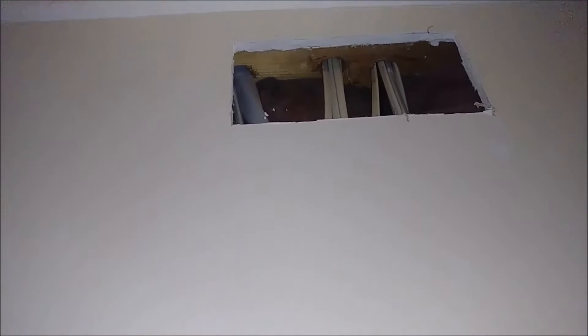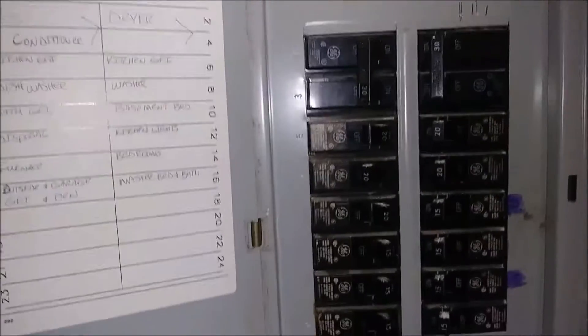The cables are here. What I want to do now is go here and drill a hole, because the 50-amp electrical cable will come from here. I need to drill a half-inch or three-quarter-inch hole in order to move the cable to this box, and I also have to get a conduit to pass this cable into the box. If you look carefully, I just put two lines here because I need to cut the sheetrock.